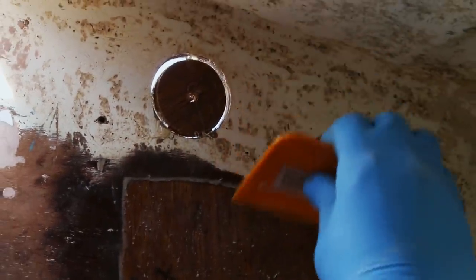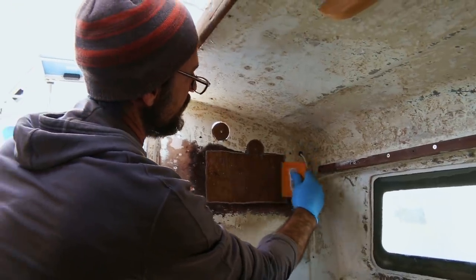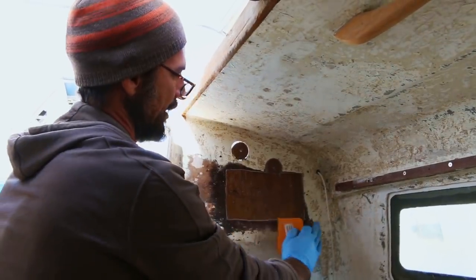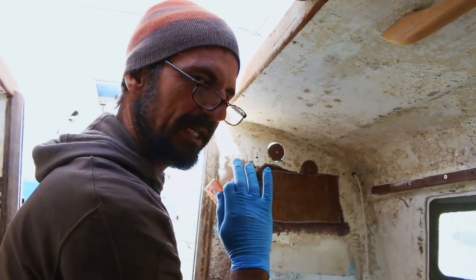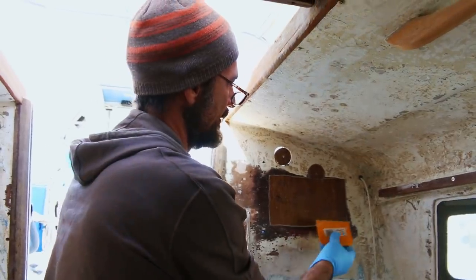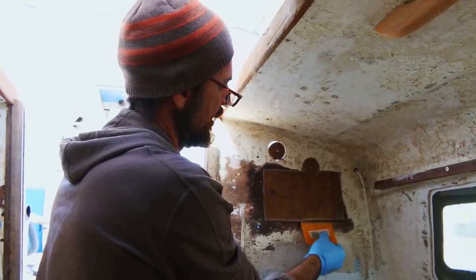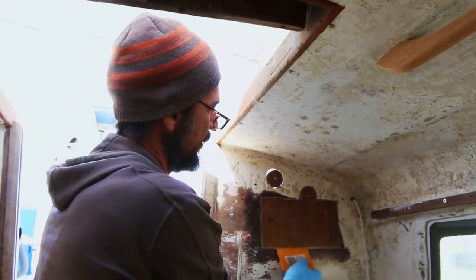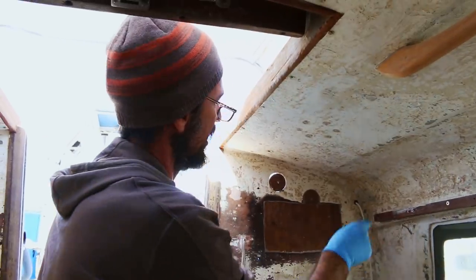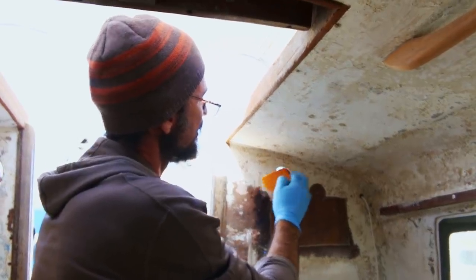Because it's hot glued in there now, I can be pretty rough just jamming that stuff into the gaps. Before I put glass on, I'll put a fairing coat — a different type of mix going into the epoxy resin — which is much easier to sand. The reason is not necessarily cosmetics, but fiberglass likes really super smooth transitions. So that hot glue — look at that, she's nice and steady now.